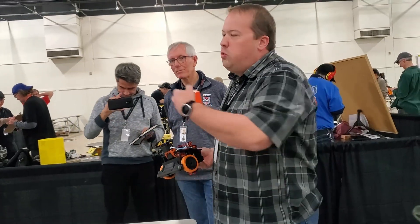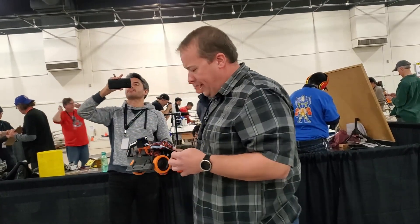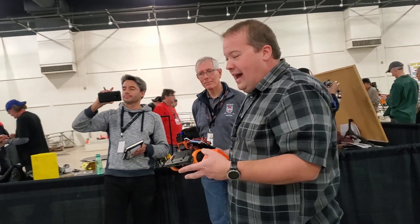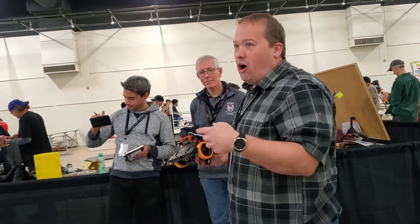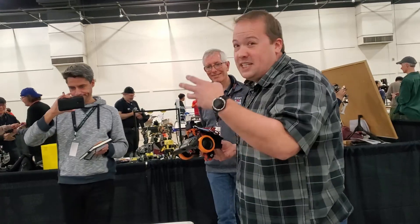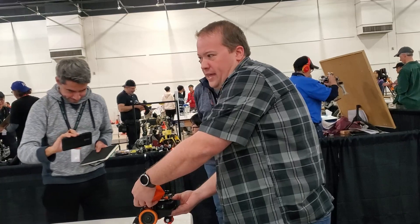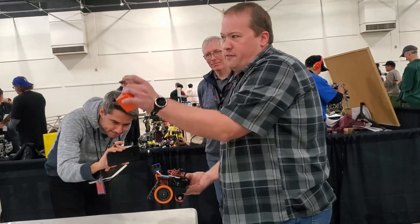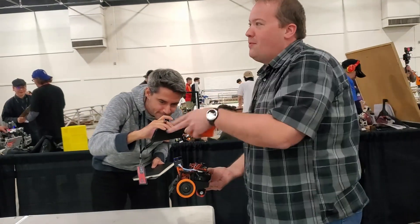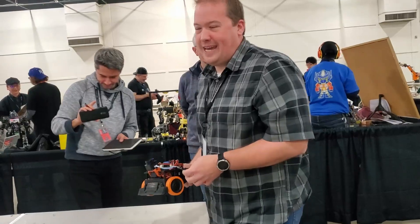It knows that it didn't quite get to the 180 — it was like 182 degrees — and as it moves forward it's off to the side a little bit. In actually making that all work, I had to fix a bug in the ARM sine/cosine functions as part of the DSP library, because if you had a negative angle like negative 1,512, there was a wraparound error in the code, and it would cause the robot to suddenly veer and shoot off the table.